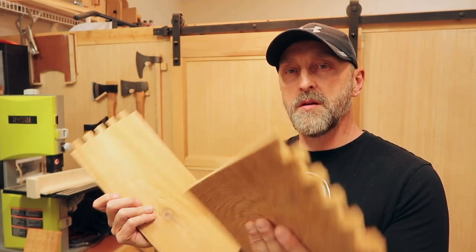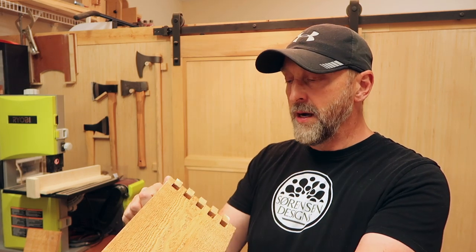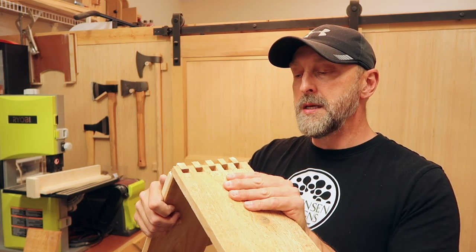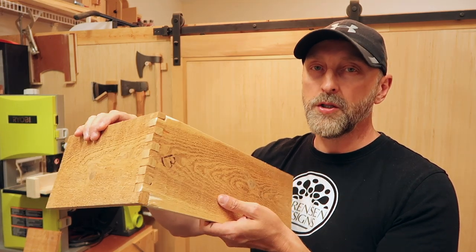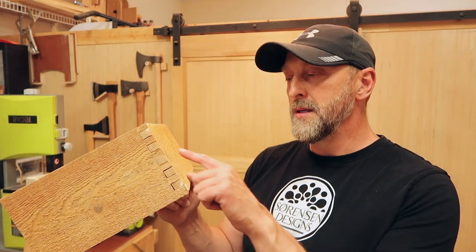I'm pretty happy with the results. It's a decent fit — if I can just do better on the tear out I think I'll get better results. What I really wanted to see was how decent the fit would be, and I'm getting a really snug fit. The method they describe in their instruction manual works quite well. The downside to using the dovetail jig is that it is primarily designed for dovetails, so you do have to be cognizant of how you cut this — using the left side first, then the right side. If you want to donate to this channel, head on over to my donation page. Please remember to like, share, and subscribe if you haven't done so already. Until next time, thanks for watching and have a great day.